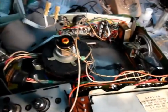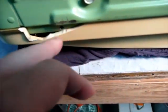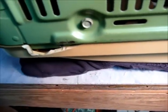I figured I'd make a quick video on how you get one of these apart to get to the backside of the chassis. You take the back cover off first — that's self-explanatory — and then you'll have a screw on each side right by the vents. Take those out, and then you have three screws along the bottom: one, two, and this third one — the fifth screw rather — was broken here when I started taking it out, so we'll see about gluing that back into place.